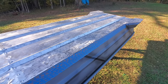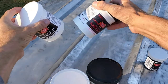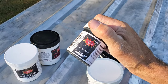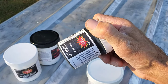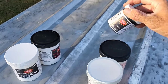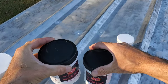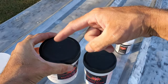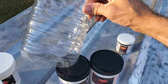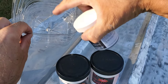Let's go over the epoxy — it's two-part. You've got Part 1 and Part 2. I've got two kits, each one quart, which makes half a gallon. This is the pigment — there's four ounces of it, and they recommend one ounce per quart. With the pigment, you need to add it to Part 2. I'm going to mix each one individually inside of its container, then pour them both into a larger container, add half the pigment — two ounces — and mix it all up.